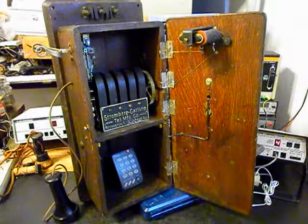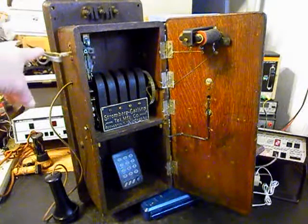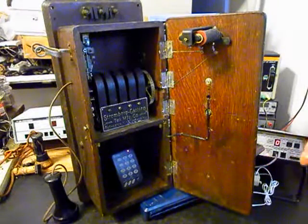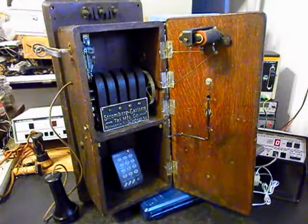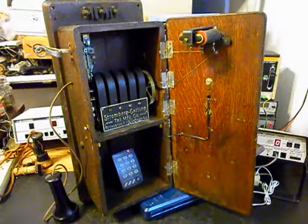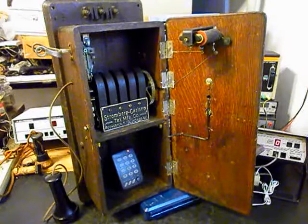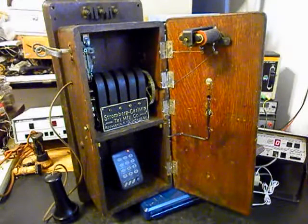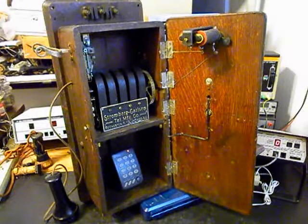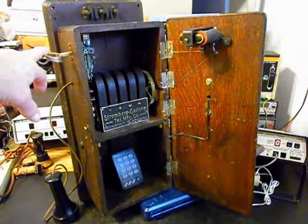I'm going to end in a two — now I want to hit flash, that'll give dial tone and redial, and the analyzer will end in a two. We can go ahead and hang up, get some dial tone, push this button on the switch box — that'll give us a line out and totally take the analyzer out of the situation. We'll call the time and temperature number and go ahead and make that call. The recording confirms: good morning, today is Friday November 6th, the time is 12:29, current temperature 65 degrees, mostly cloudy today with showers and thunderstorms likely, highs in the lower 70s.